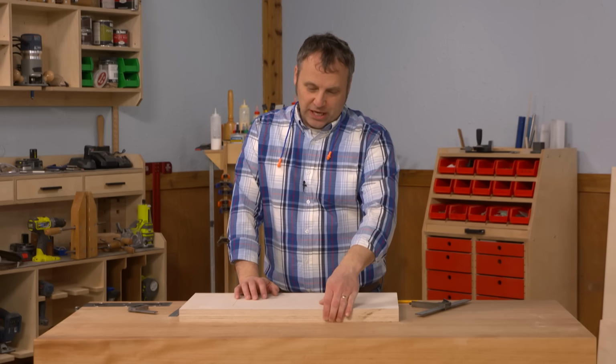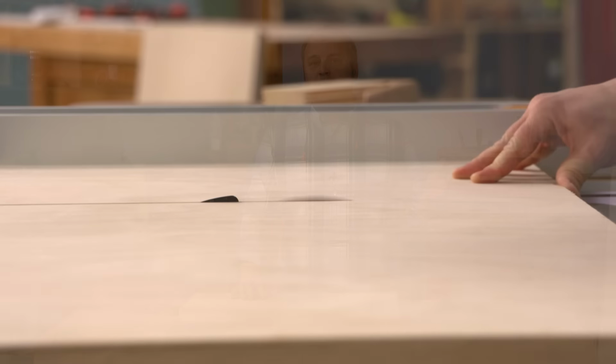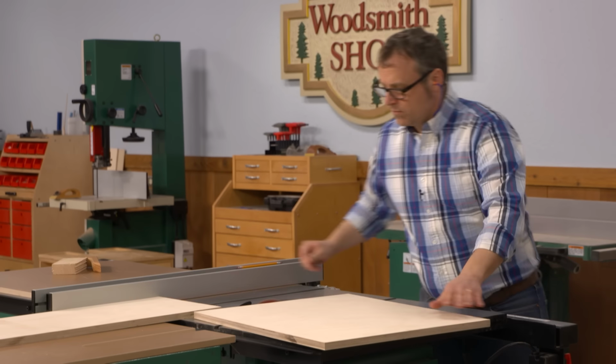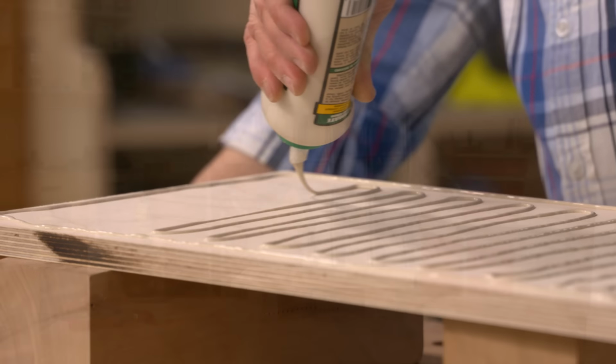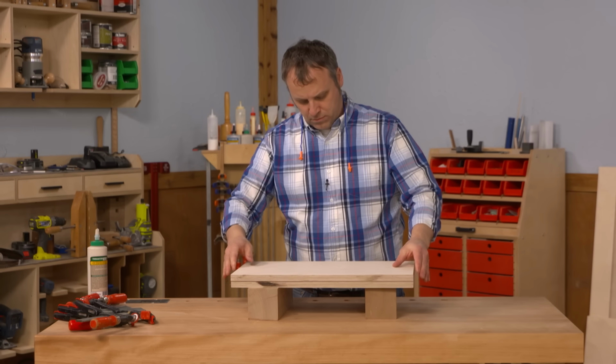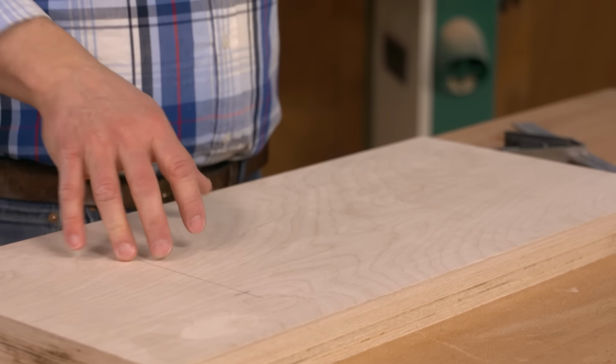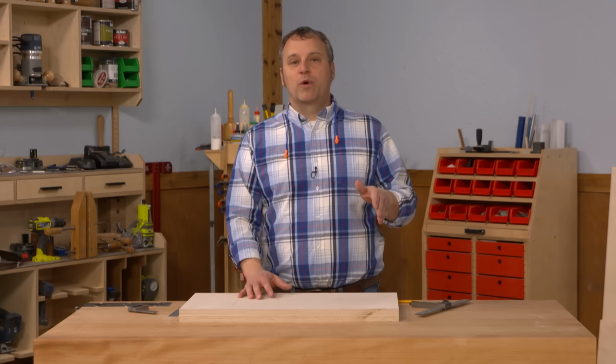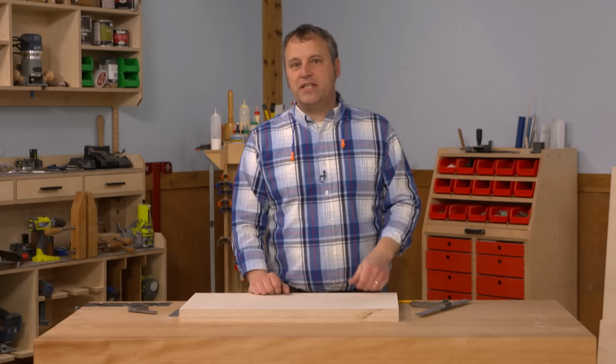Our drill press table starts out just like the work center. It's 2 layers of plywood. I cut each piece over at the table saw, and then back here at the bench, squirted some glue on one of them and then clamped them all together. Since this is much smaller than the workbench top, I didn't have to use screws like Chris did, though that's still a possibility.